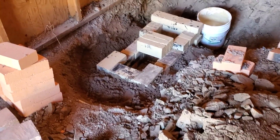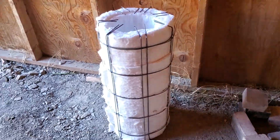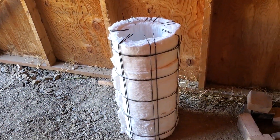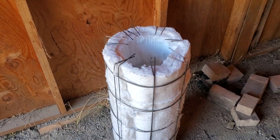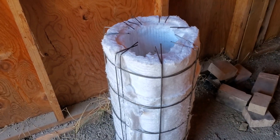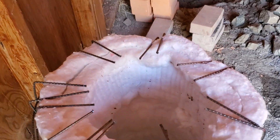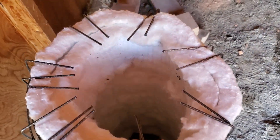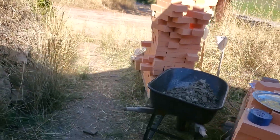This is going really well. Fire brick and more fire brick and then more fire brick. We've got what's called a five-minute riser — a super duper five-minute riser. It's made from the new Morgan super wool that doesn't have the crystalline structure that's bad for you when you breathe it, and it's still a ceramic wool that can handle high temperatures. This will be our riser and it'll go inside the heater.